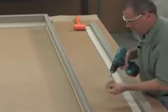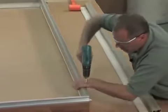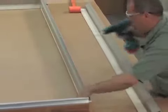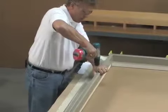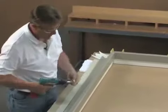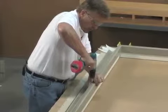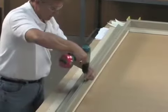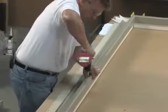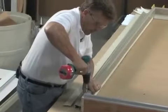There are several screw holes on each vertical. Continue down the right side, making sure that you have that cladding pulled tight to the jamb. There is a three degree angle on the back side of this clad that causes it to compress tight to the wood jamb when it's screwed down, so you want to make sure you're pulling it nice and tight. As you screw it down, that three degree angle wedges out tight to the face of the jamb so there's no face screwing required.